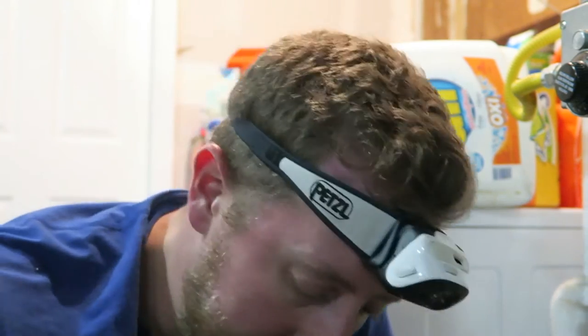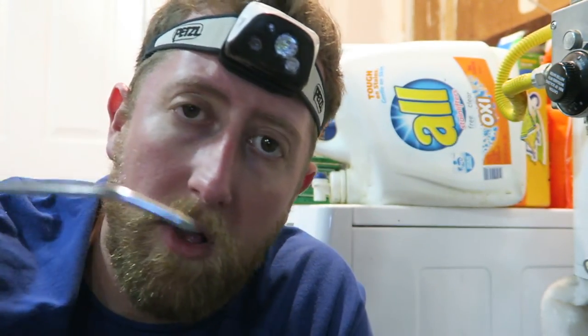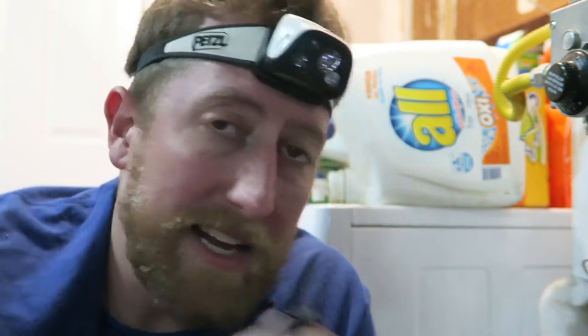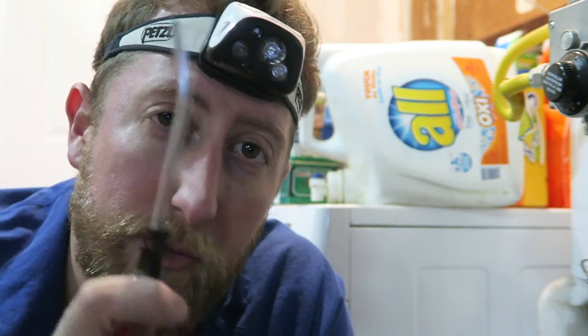Now it's time to talk about why you have and keep a multitude of tools, because sometimes things can be used in ways you didn't even think they could. In here is my copper pipe fitting kit with multiple different types of gas torches — map and propane or butane. I'm going to use that to heat up a screwdriver to red hot and then mar the inside threads of the chipped piece. The outer female end is all metal, so I can heat a screwdriver to red hot, melt the PVC, pry it all out, and then clean it up with a wire brush. A lot of people online said use a hammer and screwdriver, but heat and PVC go a lot better than heat and metal, so I don't think I'll damage the threads this way.